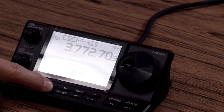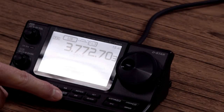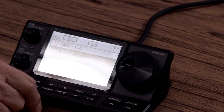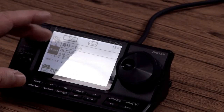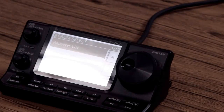Speed and pitch — that's for your CW. P-amp — that's an ATT, that's a preamp and attenuator. And then you've got DR mode. DR mode — I could always use a little doctor. Now, Tommy's going to be familiar with what that DR mode is. The DR mode is actually the DR mode in D-STAR, where you can find the repeater. Now with the repeater, it makes it easier for D-STAR from where you're talking to, to where you want to talk to. But the radio does not have GPS built into it — you can put an external GPS unit to it, and once you get your coordinates fed into it, it has the near repeater function just like on your 31.